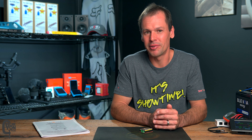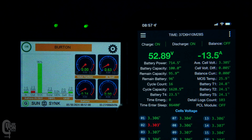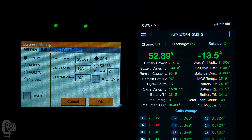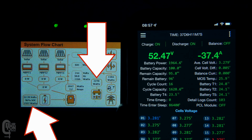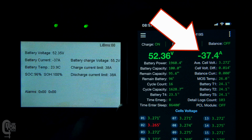So let's see what happens when we set the inverter's limit higher than the BMS limit. I've turned off the 2 kilowatt load and we are back to the base load of around 700 watts. The BMS limit is 38 amps, so let's set the inverter's limit up to 60 amps. I've just turned on the 2 kilowatt load, and the battery load has shot up to 1,900 watts. We can see a current draw from the battery of 37 amps — right up against the BMS limit — and the rest of the power is coming from the grid.